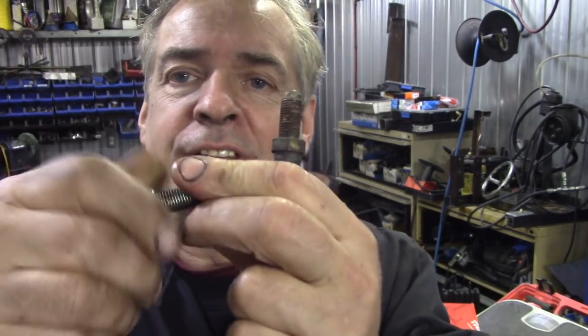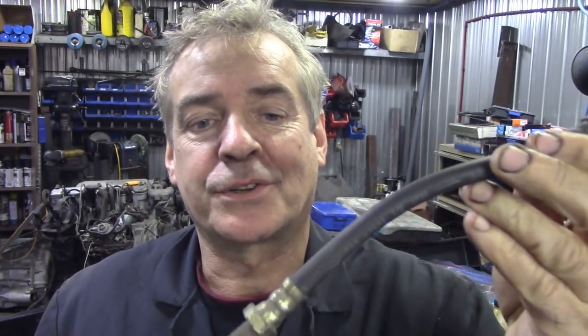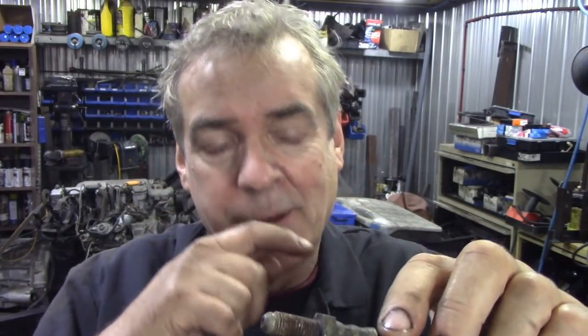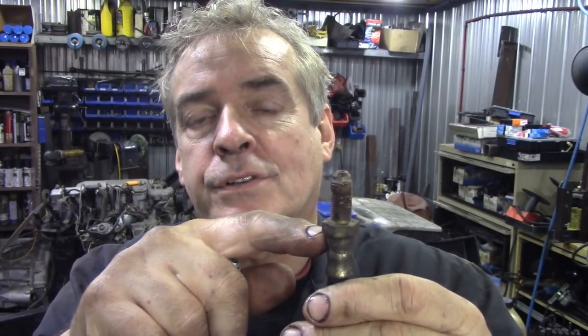This is the pipe fitting that I used for this connection here onto the plastic. Now, this was the interesting bit. Come here. Oh, we're at an angle now. This is what they came off. These flexible hoses, these are clutch hoses. They're a 7/16 UNF thread. So what I did was, I cut it off here. Now this is a pretty good one, but I always keep ratty old parts just in case. Cut it off here, clamp this in the drill press, and with the disc grinder, cut just under the head of the hex, and then with a bit of luck you can pull this sleeve off and you end up with that.